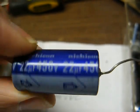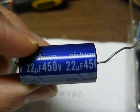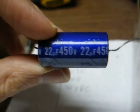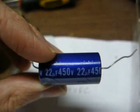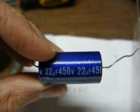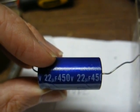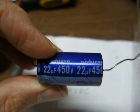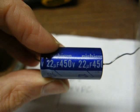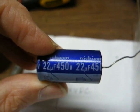Let's say this capacitor was defective and we needed to replace it. We'd preferably want to stick with a 22 microfarad cap. Although, depending on the application, if it was used as a filter capacitor we might go a little higher — say a 33 microfarad if you had one on hand. But whenever possible, I like to use the same value that was originally used in the equipment.